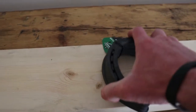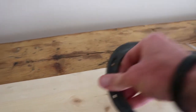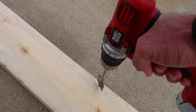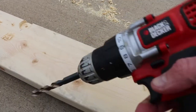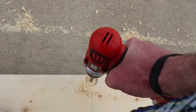Now that we've made those marks, we're going to take a horseshoe, line it up at the center of each mark, and find the center point of the back end of that horseshoe. Once we've done that and identified the center point, we will drill through. The next step is to countersink using our paddle bit so that the back end of the bolt sits flush below the surface of the wood. We then take our regular drill bit and drill completely through so that our bolt connection is solid.